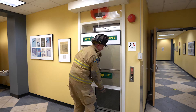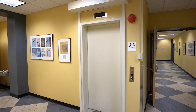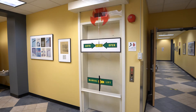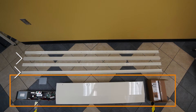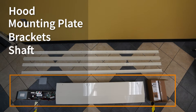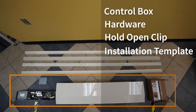Before you install the smoke shield elevator curtain, review the framing coordination document and verify that all components have arrived and that they match the material, finish, and color of what is listed on the job construction drawings and what was ordered. For this door, the list of components include two wall guides and two face guides, the head box assembly which includes the hood, mounting plate, brackets, shaft, curtain, springs, motor, and hardware. The control box, hardware, temporary hold open clip, and installation template are also provided and required for installation.